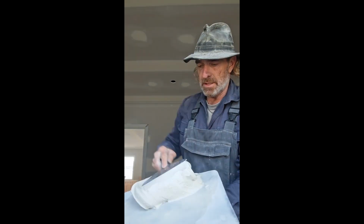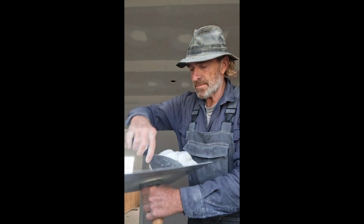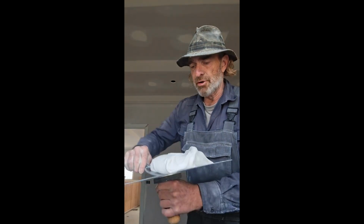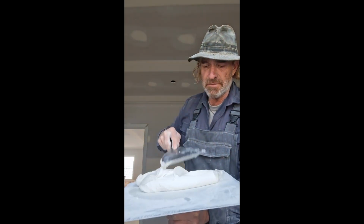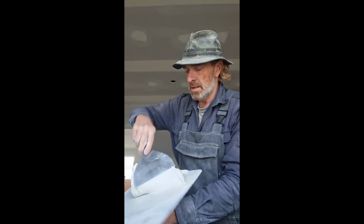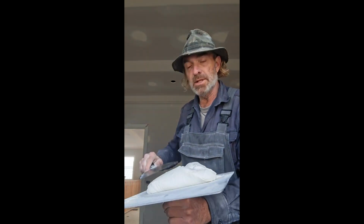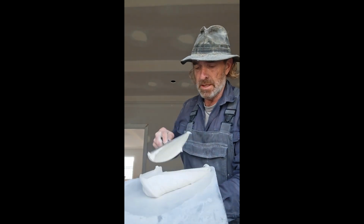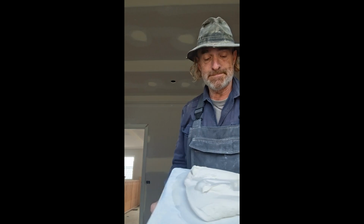What else makes mud go off? Table salt. I used to use that a lot, but it's very grainy. It's very hard to get it to dissolve properly in the mud so it's not scratchy in your work. But gypsum dust, slice open a piece of plasterboard, scrape the inner, and you've got gypsum dust, and that will make the mud go off quicker.